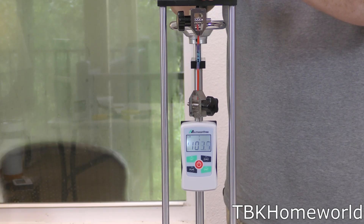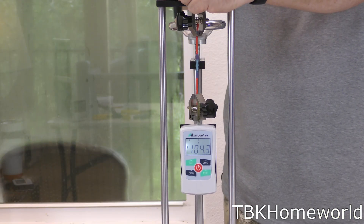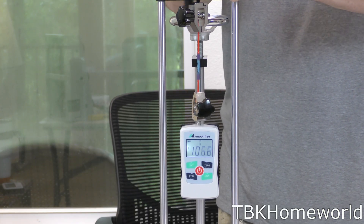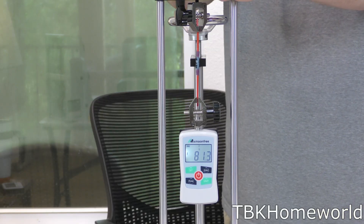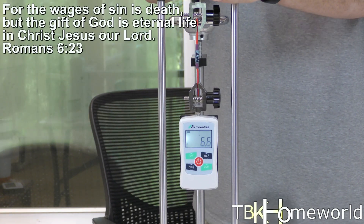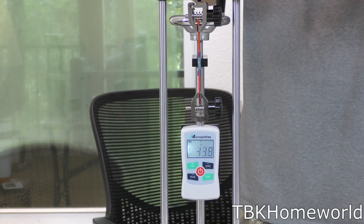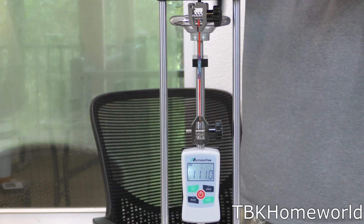On this particular test we fully expected to have some clear winners and clear losers. But on all of these pull tests we did not have a single failure of the connector itself. I'm really excited about this jig because it's going to help us with future testing as well. This proved conclusively that these heat shrink butt connectors do an extremely good job, as long as you have a good crimper. All of these failed with the wire — most failed with the sheathing either being completely sheared off or stretching — and we had very consistent, close numbers across all our data.